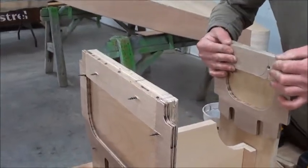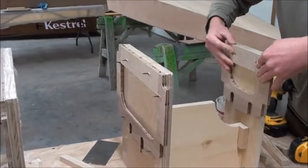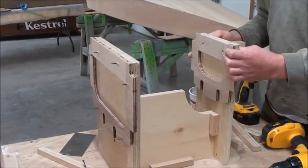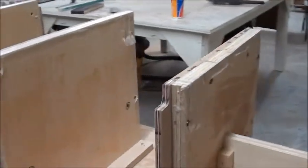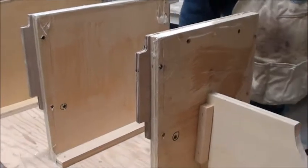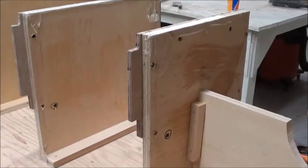Shimming it up — these cleats and all the spreaders have to come off to get this off the jig. So before you put the sides on, you've got to make sure those are all removed, or else you'll never get this thing off the jig without tearing it up. We also take out the top screws on all the bulkhead stations and just leave the bottom ones in, because they're easier to reach before putting on the sides.